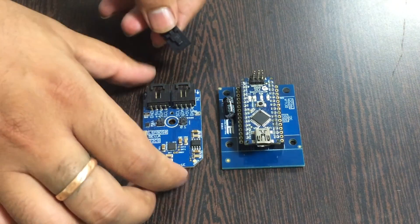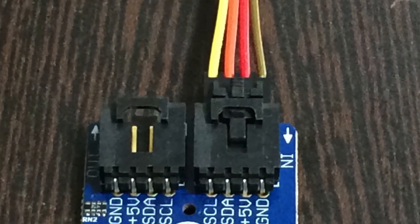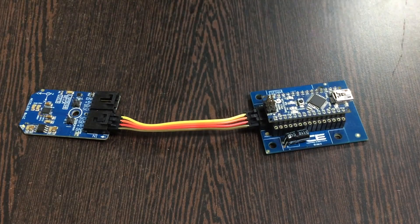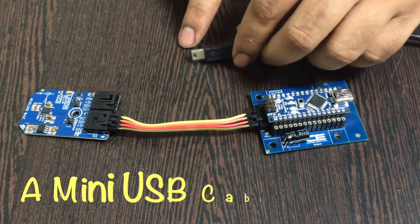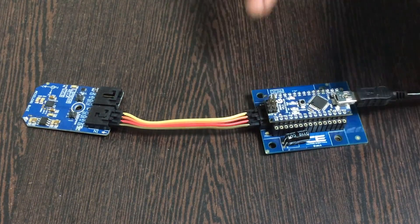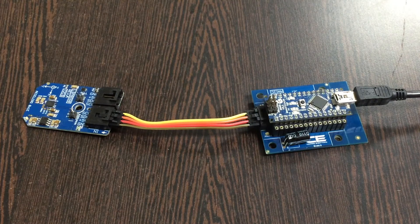Make the connection of the cable and the sensor, making sure that the ground wire of the cable is connected to the ground terminal of the sensor. The same goes for the I2C shield. The last part is to provide power, and for that we require a mini USB cable — just like this — and we are done.